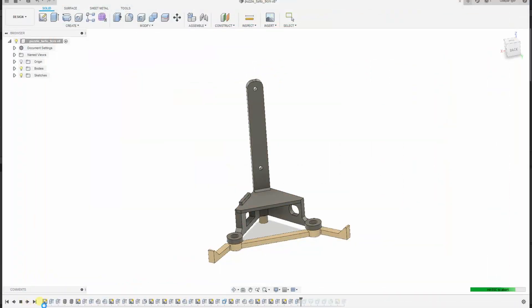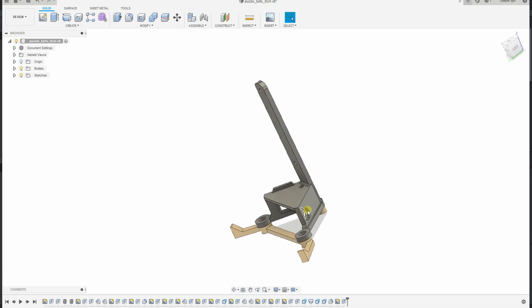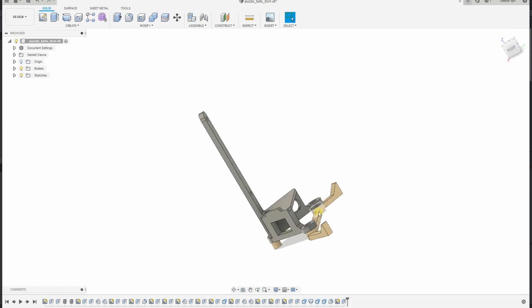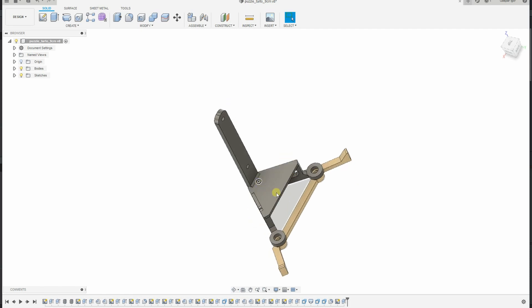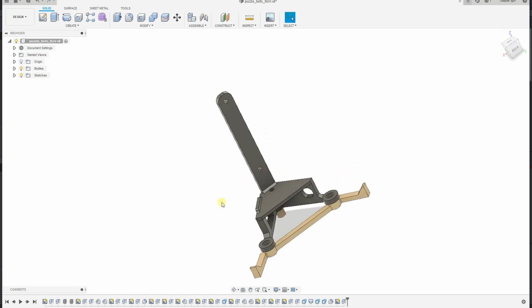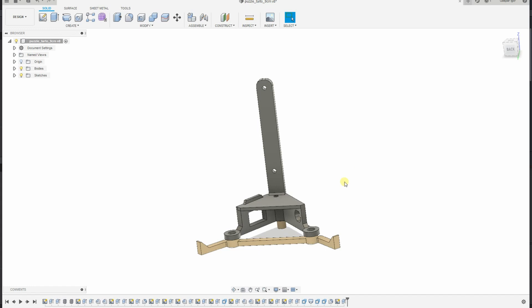These are my design steps in Fusion 360 for the LED holder. This hole here is for the female 2.1 millimeter power plug-in. On the other side we have the hole for the switch. This piece here makes it easier to use the switch, and this small hole is for the wires. These two holes will be used to fix the LED to this holder. We can 3D print this part and put it together.